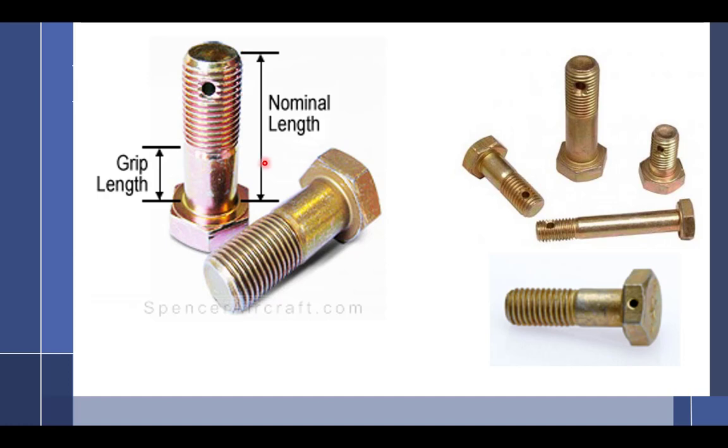What grade bolts do they normally use in aircraft? In automotive SAE, you have grades of bolts, right? And I believe it's a grade 5. But it isn't marked that way, and it's not something that's general knowledge. It's just an AN bolt. Now, the funny thing is they look like grade 8 because they're cad plated. But they're not. I worked with somebody who'd always say, if you're going to substitute an aircraft bolt for an automotive bolt, always use a grade 8. I'd say, why? Because they look the same, unless you look at the head, and it's clearly not. And that's how you tell the difference.